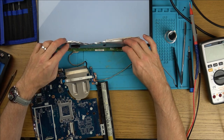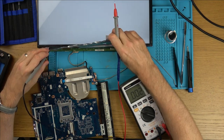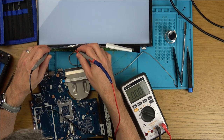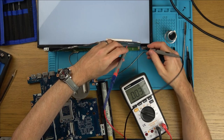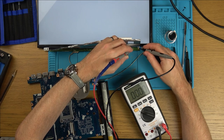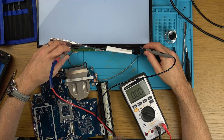And there's loads of test points down here, like voltage in, voltage out, and then all LEDs. And for example, when I go with my meter here, I am getting voltage on. I don't know what it should be, but for example, if I go to voltage in, it's 3.3 volts. I think this one's, yeah, VDD in. Have a look here. 3.3. And check out the voltage out. It's really high. Voltage out. See there, 26 volts, and LED 4, 0.47, LED 3, 0.52, 0.53, LED 1, 0.57. So when I go across just random ones, I'm definitely getting voltage across.